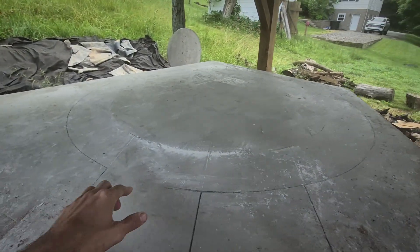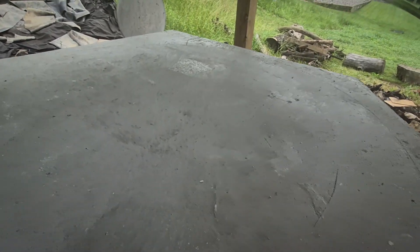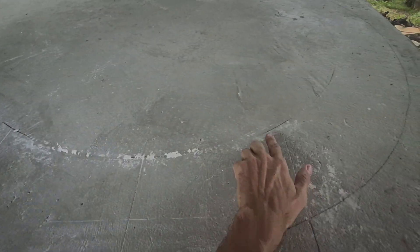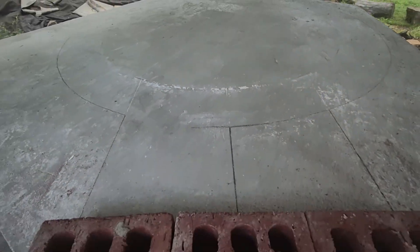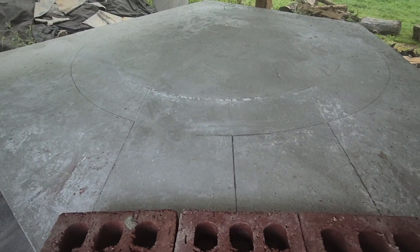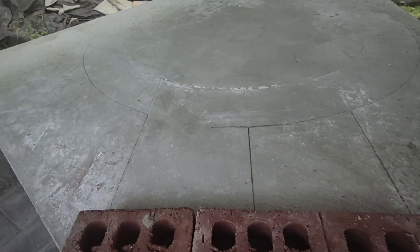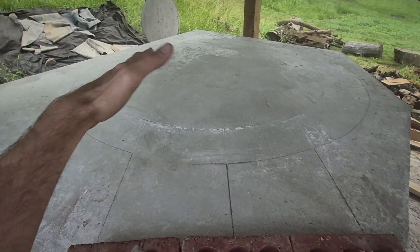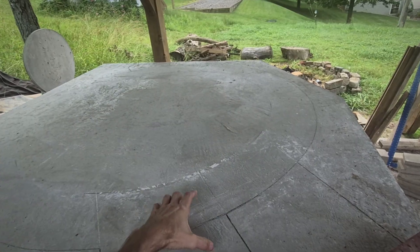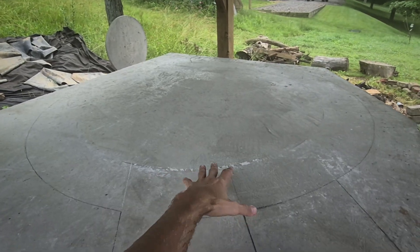So we are doing a 22-inch opening. The points will be here and here — that's the calcium silicate board. The opening is going to be here and here, and then we've got the entrance way here. We squared this up — this is also 22 inches. And then this is 23 and a half back. I am going to get a good throat to the oven, because you want your heat to come up and then roll in this hallway and then go out the flue. So you get a really good draft going and you can convection cook here.